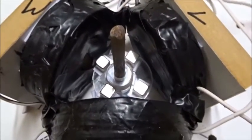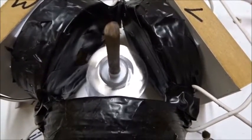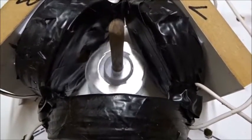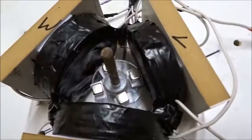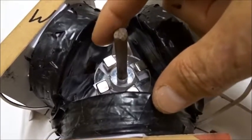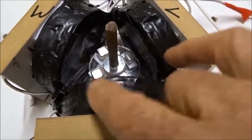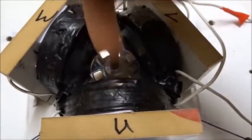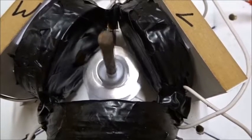On the other hand, if I have alternating out-and-in poles on the four magnets and put on a little power, it spins very nicely clockwise — very powerfully as before. We alternate the poles between NS-SN. Another way is to have NS-NS pointing the same direction like a bar magnet, and the opposite bar magnet SN-SN the other way — and again it spins very nicely.